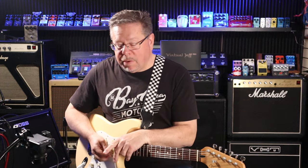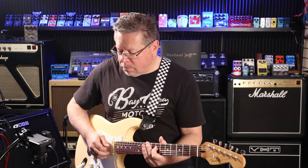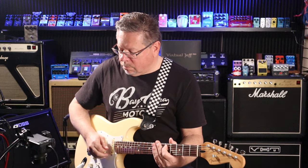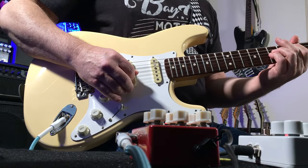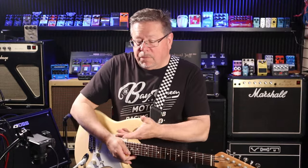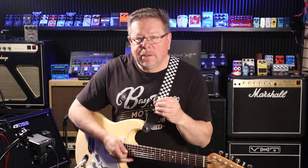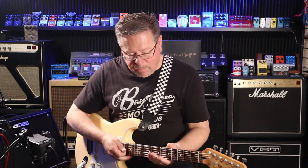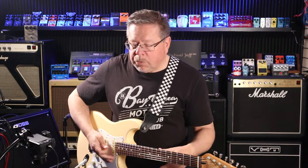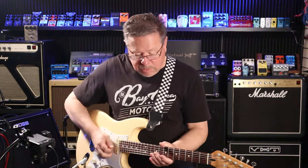Now, this is the glitch that happens if your power isn't absolutely dead on. And that's a glitch. You know, maybe my fault for not having the exact power supply, but I don't think that a compact pedal like this should be that sensitive to voltage. Now, your shimmer mode was really sensitive, same as the octave mode when I had 250 milliamps going in at 9 volts.